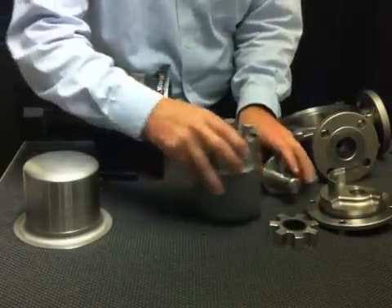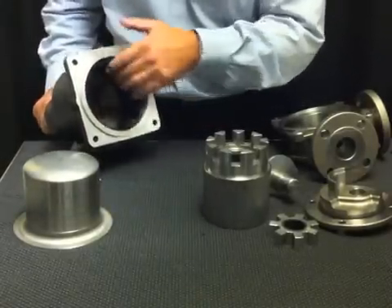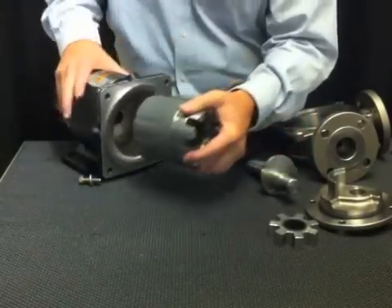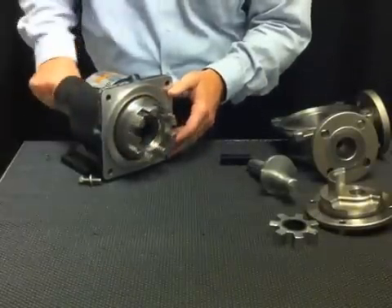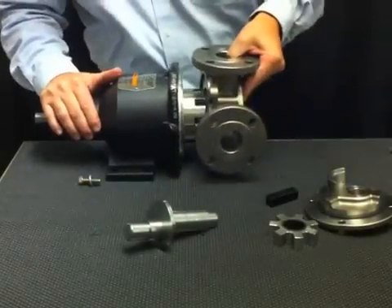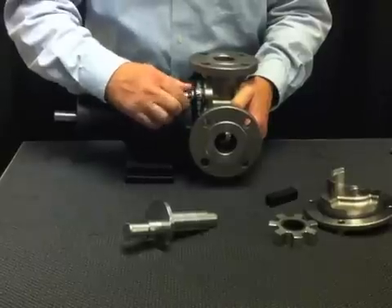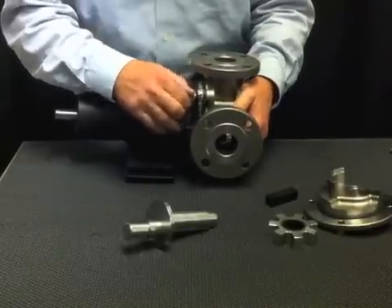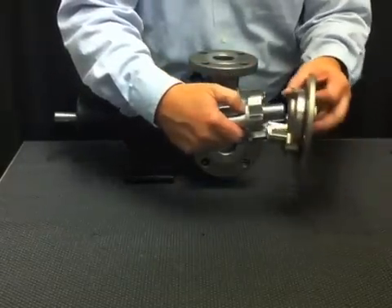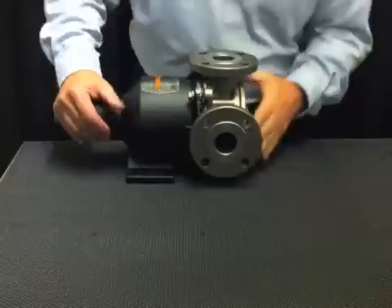Let's go ahead and start reassembling this pump. Just to have a quick review of magnetic coupling technology: the outer set of magnets hooked up to the motor rotate on the outside of the containment can. When I bring the inner magnets mounted on the rotor assembly into proximity, I form a magnetic coupling. So when the motor runs, my rotor turns and you have no shaft penetration — there's no rotating shaft within the pump. I now bring the casing into place and bolt it together. The O-ring on the casing seals against the flange on the containment can to make a tight seal.